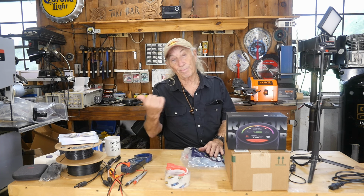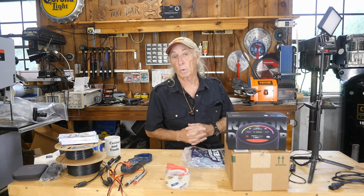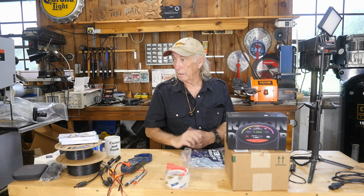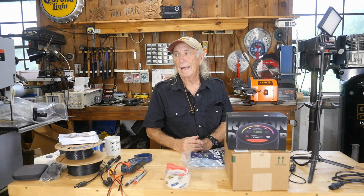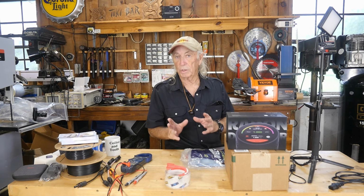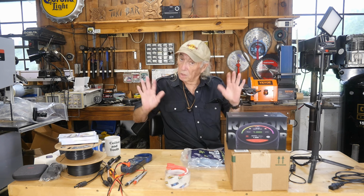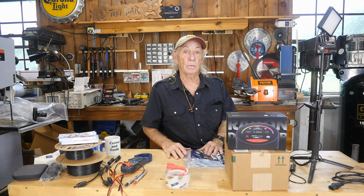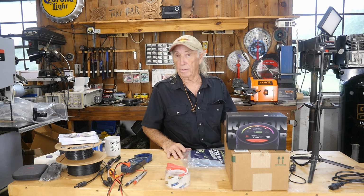So I had to do that a couple times on it and checked it, and yeah, the auto bed leveling is working, and it's setting the nozzle right where I need it to be. Somebody had suggested changing the nozzle, and yes and no. The machine came in refurbished, which includes a new nozzle. So let's just assume, yeah, there's that terrible word, let's assume the nozzle is new, that it should be okay. That's not a new nozzle with a problem.